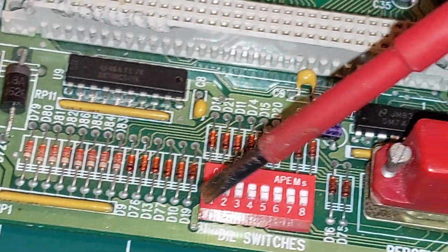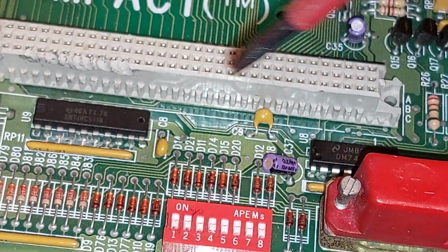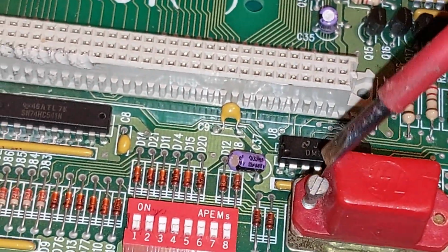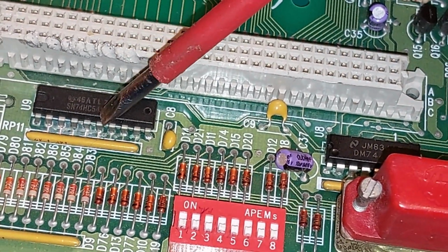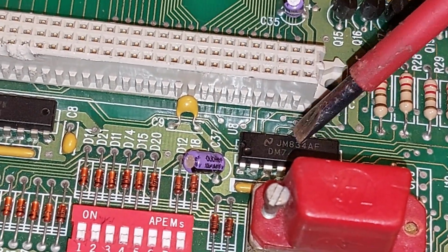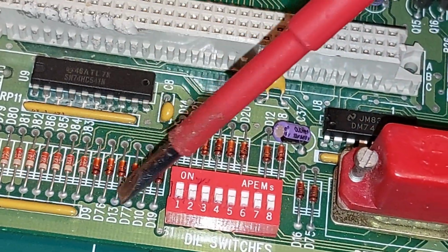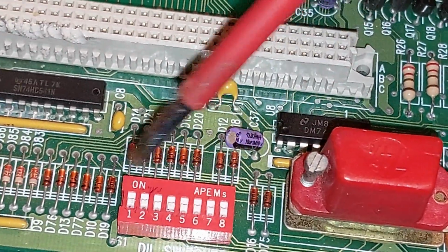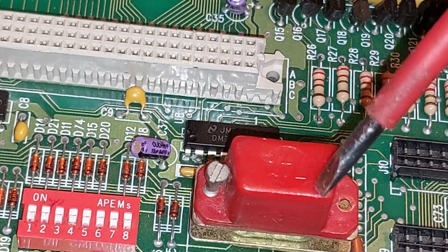And you can see loads of diodes and some switches and a percent key around. So, that's your switch matrix. Yeah. See how easy it is? We're figuring these things out already. This is your switch matrix. If you're unsure what something does, look at its data sheet, and that'll give you a good idea of what it's doing on a circuit. So, I'd imagine this is the switch enables, the sources, and that's the sinks. And these all form the anti-ghosting for the matrix itself. Maybe blocking diodes so we can turn various switches on and off, stuff like that. Percent key forms part of the switch system as well.